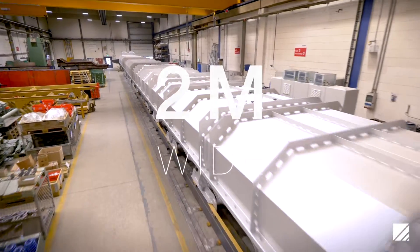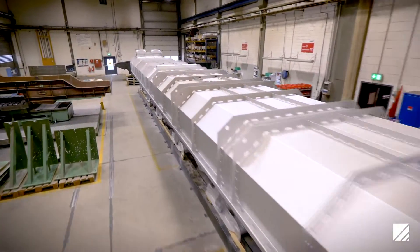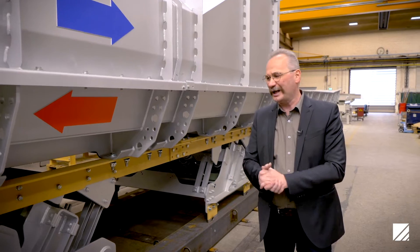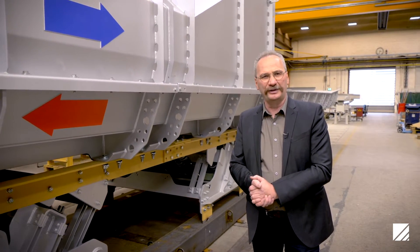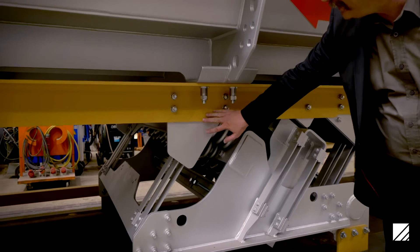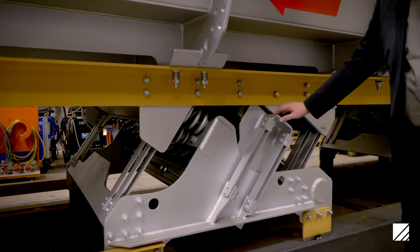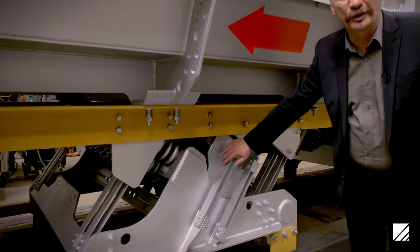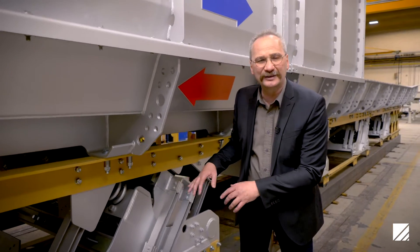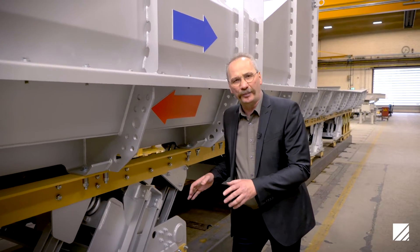This machine unites three engineering disciplines: machine dynamics, thermodynamics, and fluid dynamics. Regarding machine dynamics, this is a mass-compensated, or balanced, sub-resonant tuned single-mass resonance conveyor. We have the main mass here, connected to the ground via center traverses, and individual balancer masses underneath which counteract the main moving mass to equalize and balance the dynamic forces transmitted to the ground, reducing them to the possible minimum.